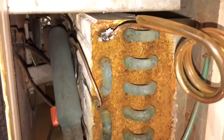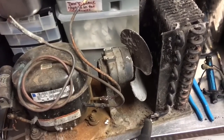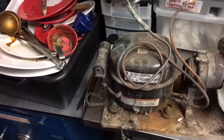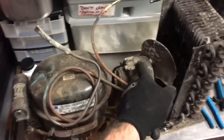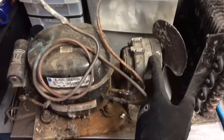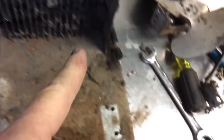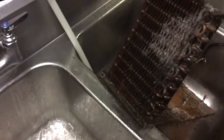We got some solder up there. Let's see how clean we can get this one out. I got it up here where I can work on it and I take out both connectors from the condenser coil, because the new style compressor has a different body so it's going to pipe up different. We're going to replace this condenser fan motor too, and the compressor — this assembly is done. Let's go scrub this thing. Make sure you get the ends taped up real good — you don't want water in your condenser. Let's go clean up all this stuff.